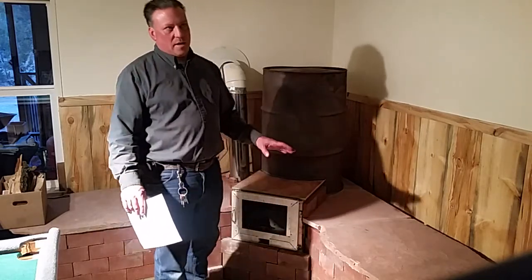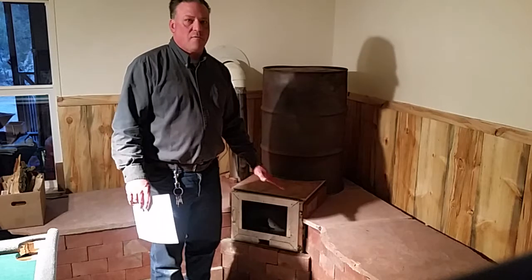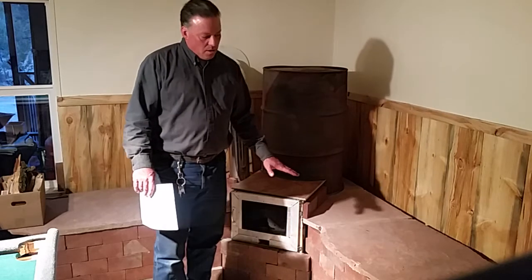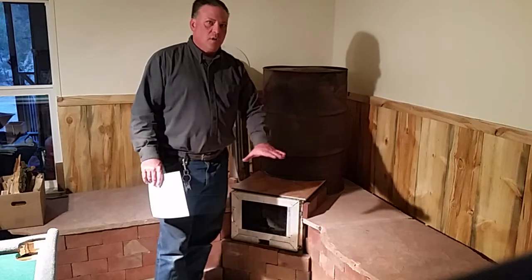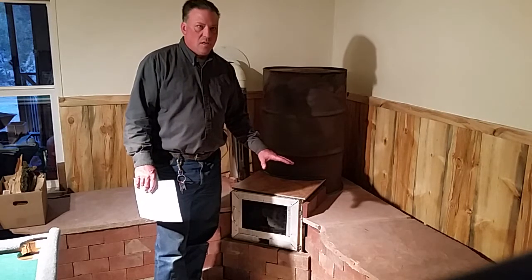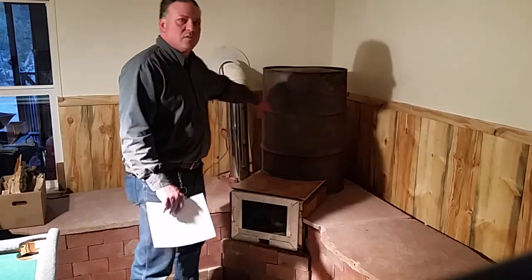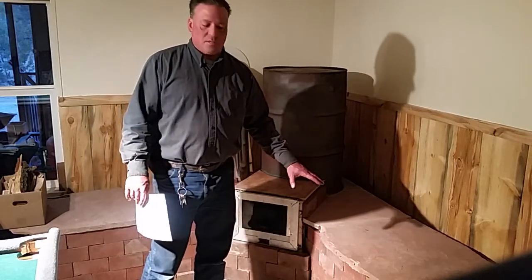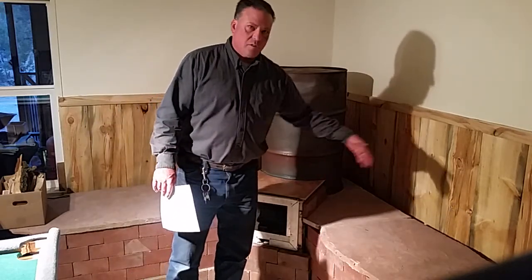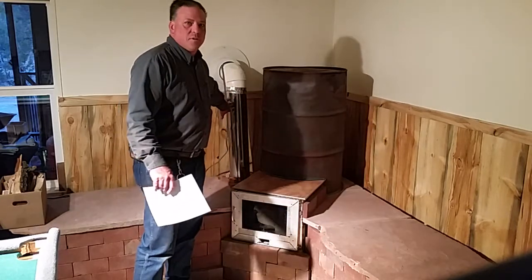I started off at the bottom of the floor with three-quarter-inch plywood to reinforce the floor a little bit. On top of that I put a strip of metal all the way around, lining the whole entire base of the rocket mass heater. After that I put some 16x16x3.5 blocks which weighed 76 pounds a piece, lining the whole outside perimeter of the bench seats. It's basically one whole bench seat, all hollow in the center — between the block and underneath the flagstone it's all hollowed out. Those are where all the exhaust gases go before they go up the six-inch pipe.